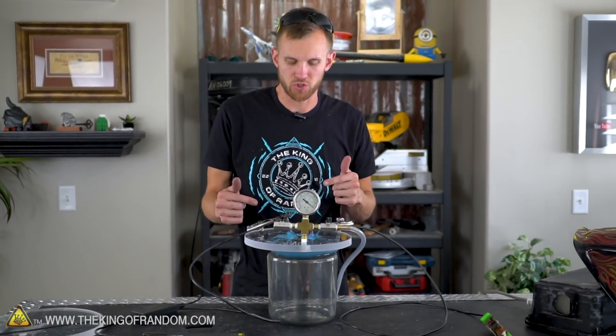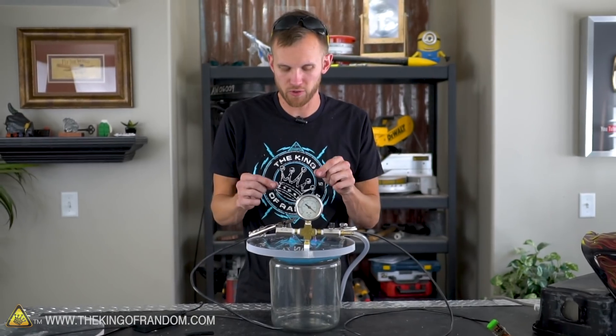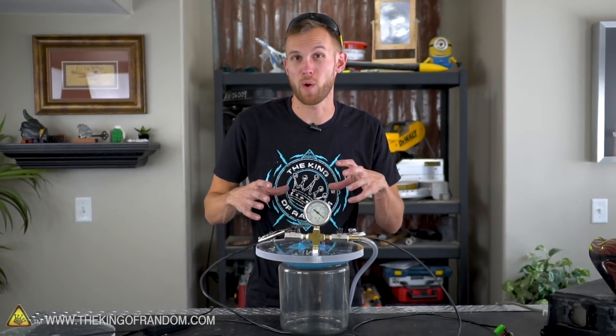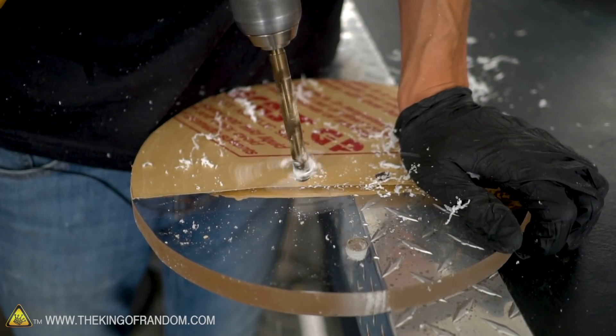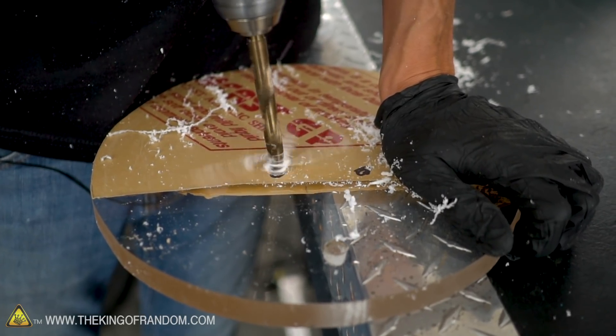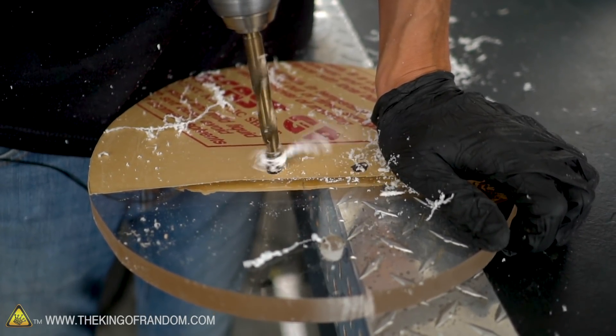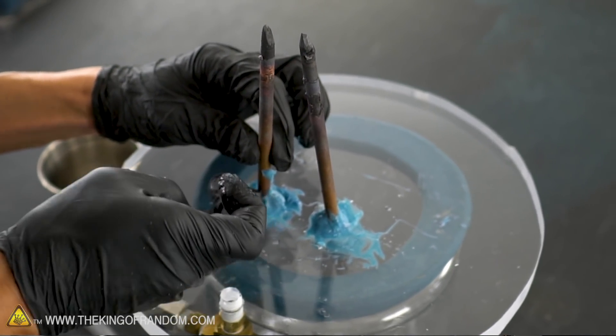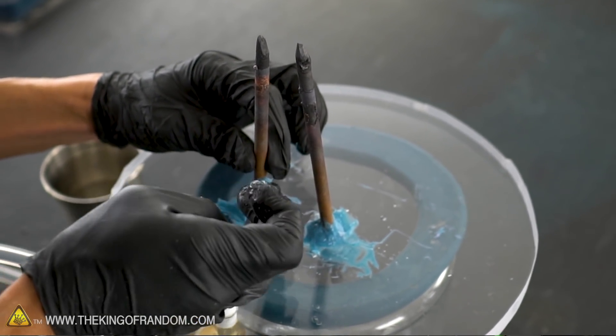What do you think? Are there other ideas you think we should try with our arc furnace? Are there other tools you think we should try and set up to be manipulated while inside a vacuum? I think drilling holes into the top and making a rubber or proto-putty seal does work fairly well — I was still holding a vacuum and I was able to move the rods around. I might be able to get some other tools down inside to move stuff while under low pressure.